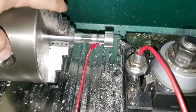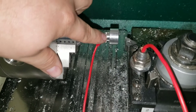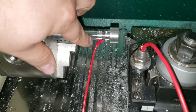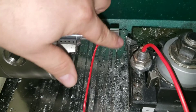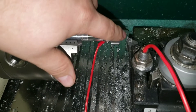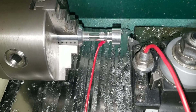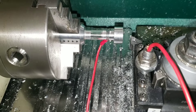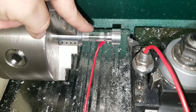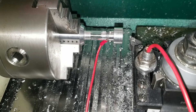The premise is it holds a piece of acrylic in the chuck, and this wedge right here serves as a safety. If it over-travels in the X direction, the acrylic snaps. If it over-travels in the Z, this wedge right here breaks the acrylic. So it does have a built-in safety so I don't crash and break a tool, and the acrylic is five cents worth to replace.